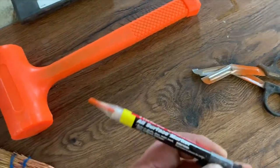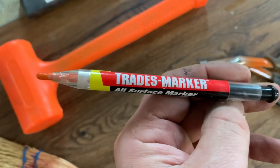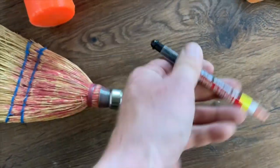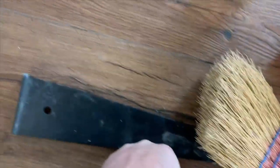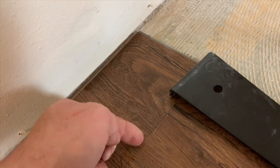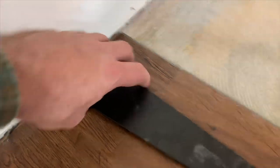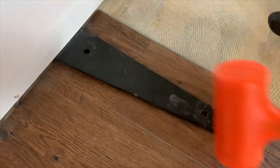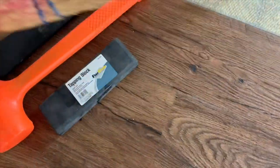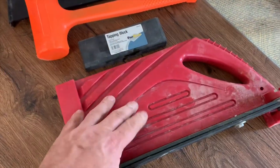Of course I've got my scissors and a marking pen. If you don't have one of these yet — it's like a pump-up crayon — it works awesome. You can write on hydraulic hoses, whatever you want. Here's another tool I'd strongly recommend: a laminate wood pull bar. When you're trying to tap a piece into a seam it's almost impossible otherwise, so you slide this where you need it and tap right there with your dead blow. Works great — that is really nice.